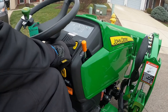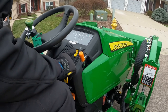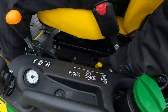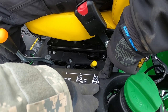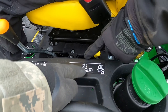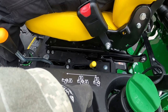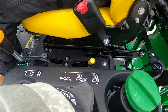That's your PTO. Okay. That's the PTO for all the PTOs, right? Front, middle, yes. And then the selector was over here on the side when he was showing you. That's the selector right there. So this is the middle blade, which is 2100 RPM. Yep. So I'd be in low gear and then 2100. Yep. And for this one, I can do both the rear and the front middle. That will spin both of them, yes. And this one is just for the back. And just the rear. But if it spins both of them, I have to be at 540 then, because it's the lowest.